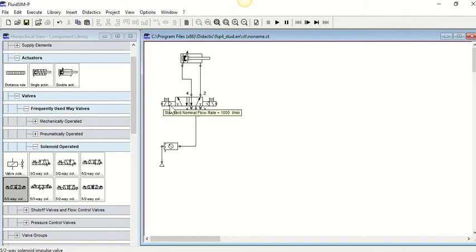If I have activated this valve, the cylinder can start extended, and if I leave the valve and don't reset it back down, it will still stay in that last position. You can get some with an internal spring that will revert back to a neutral or rest position. But this one, if you activate it on this side, it will stay in the activated position. And if you put it back to rest, then it will stay in the rest position. So that's what we mean by an impulse valve or a detent valve. That's really all we need for the pneumatics to start off with.